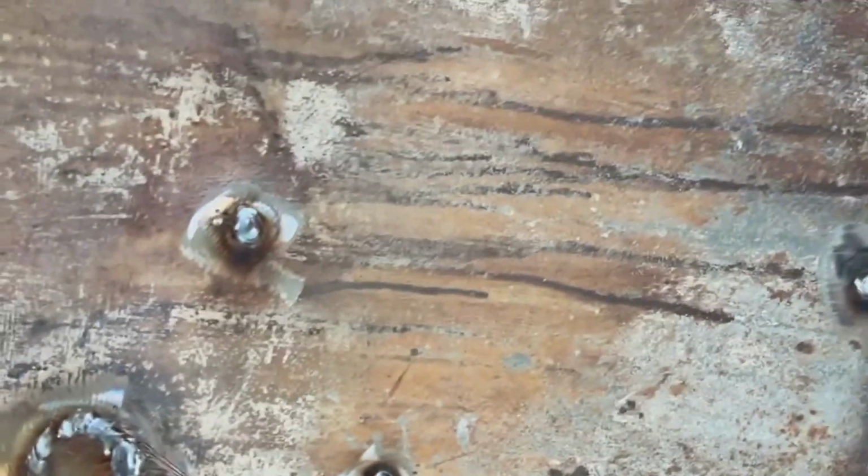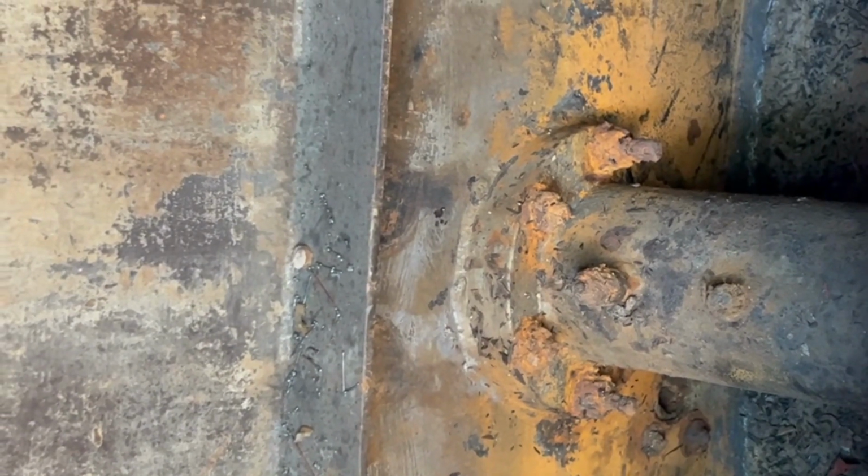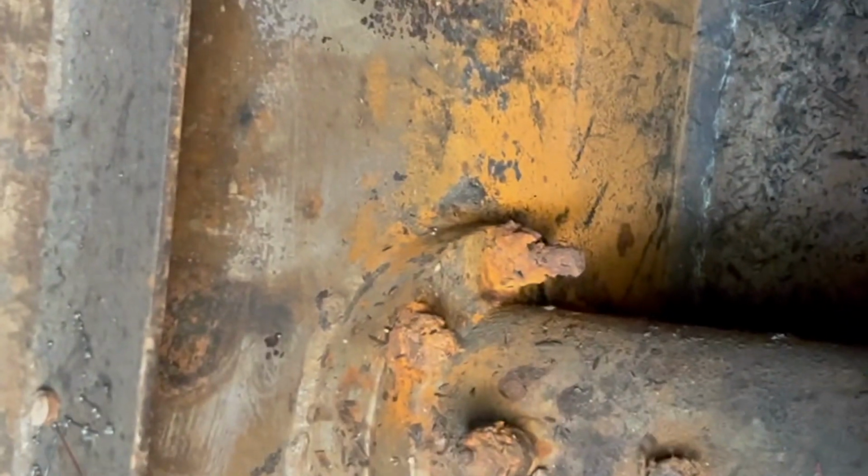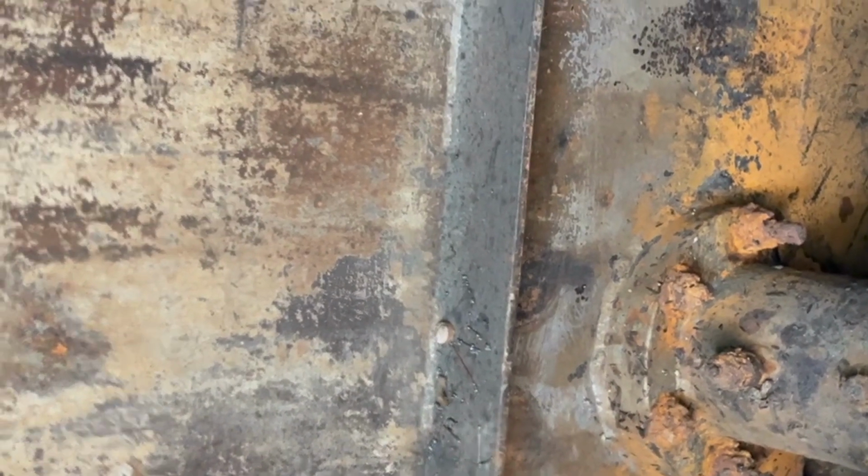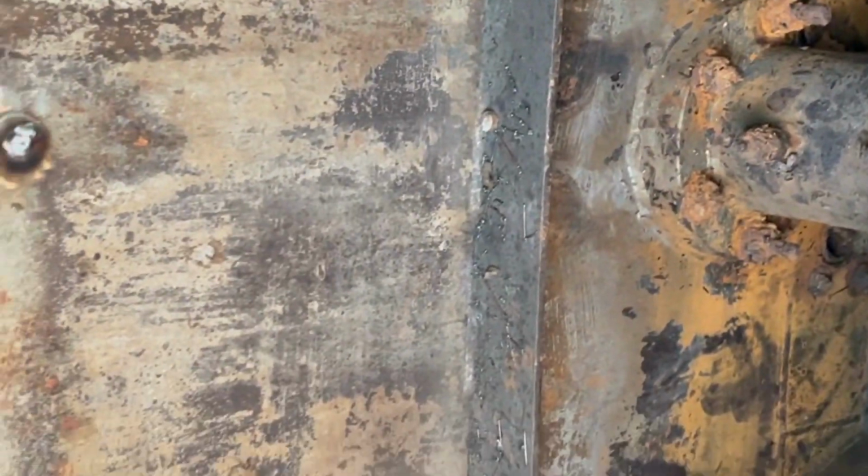So you welded up all that wall there on the other side, so it's all plugged up. I'll cut all these bolts out of this stern tube too. It goes through to the front of the engine room. So we can get that out, clean all that up and fix that up.